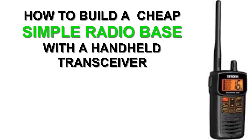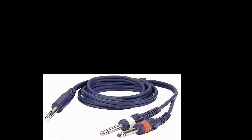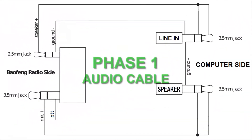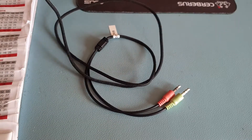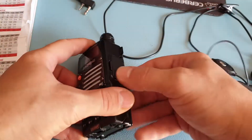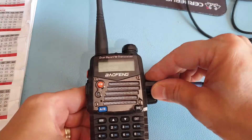What do you need to make a radio shack with a small handheld radio? You need an audio cable to connect the audio of the transceiver to the computer and back. For the audio cable I use this wiring diagram which is compatible with my Baofeng transceiver — if you have another brand you should check the proper connections. I found this recovered audio cable from a broken computer headset; the audio jacks now used to connect the transceiver's headsets are used to take the audio to the computer.